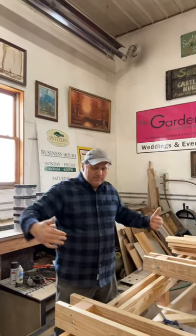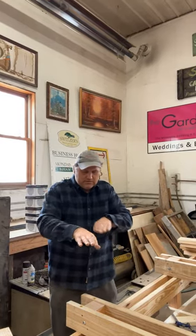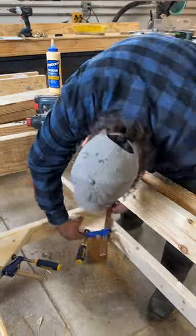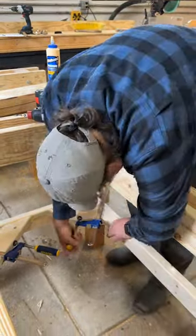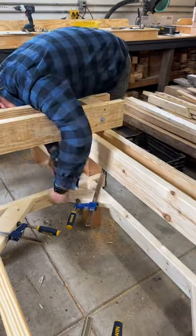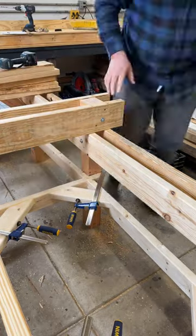The fourth way is if it were to be hit from the end, it would get a kind of racking on the horizontal plane. So on the inside here I added four little gussets, glued each end because we only had one point of contact, and then four screws, two on each end. That will give me solid bracing all the way around.